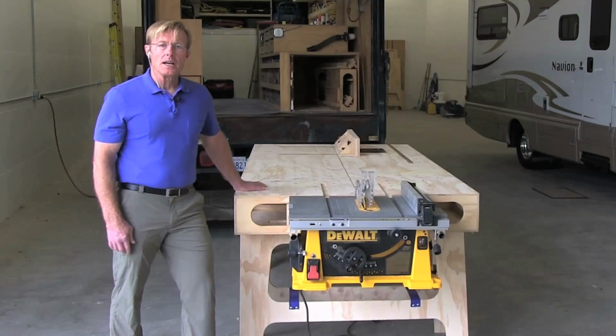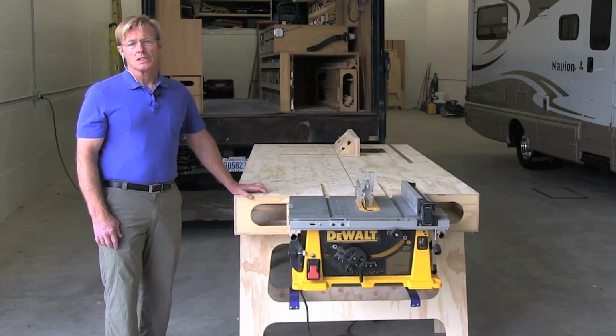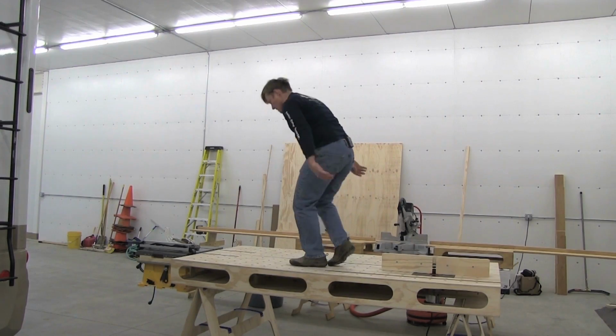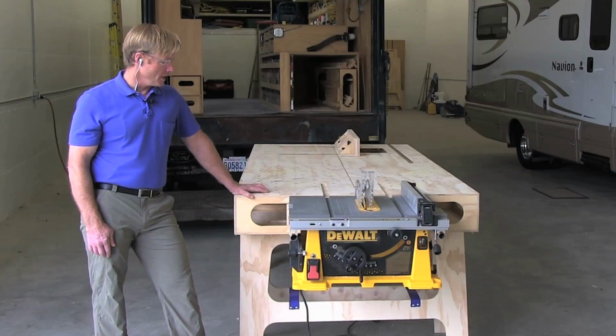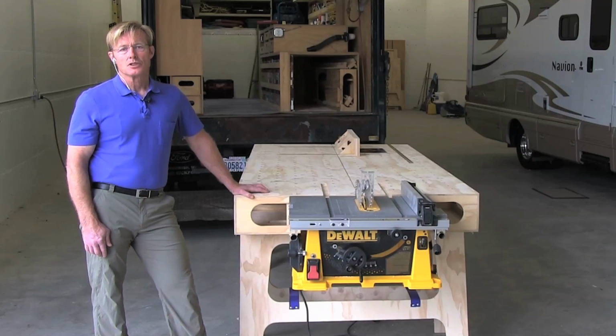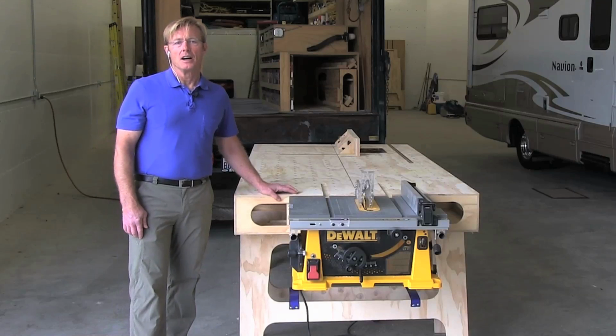And obviously, to hold things like mantles and cabinets, the bench needs to be quite sturdy. So what made you opt for using 1/2-inch plywood rather than the 3/4 inch? I decided that the design that I was working with, more of a truss, a box beam, I was going to get the strength from the engineering and not from the mass. And that was intentional. I knew that building this box basically so that I could have an inside usable space, I would not need the mass, that the 1/2-inch would be as rigid as the 3/4, and that gives me the added benefit of weight.